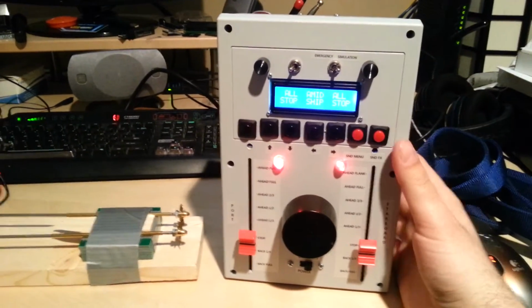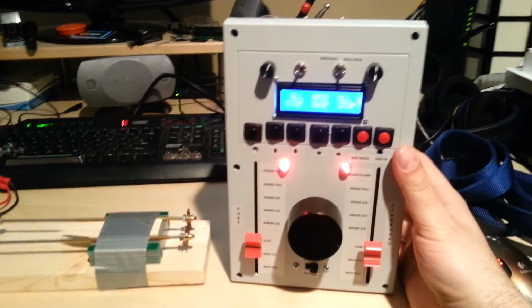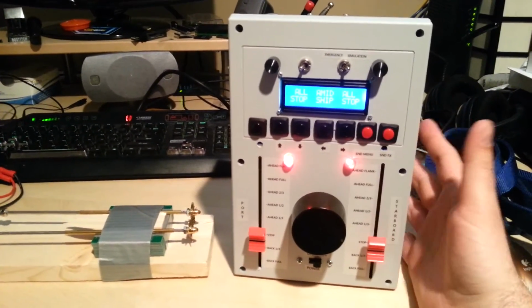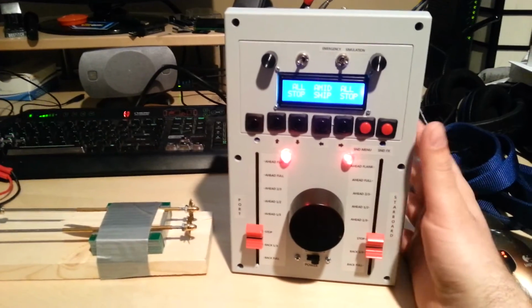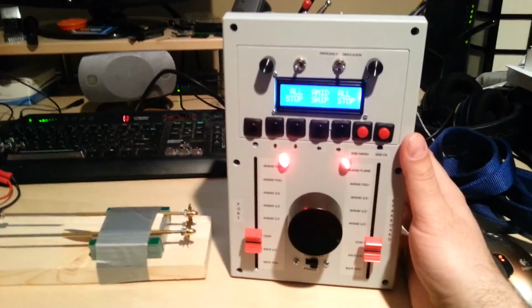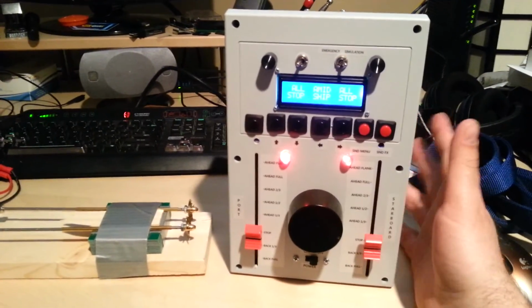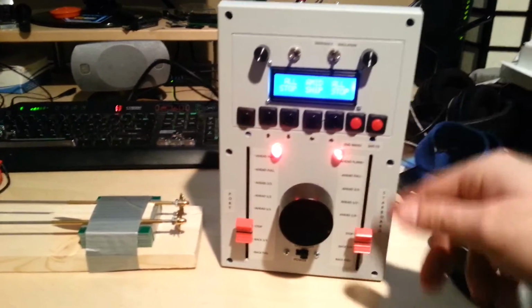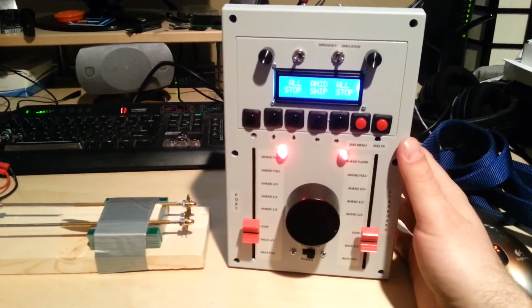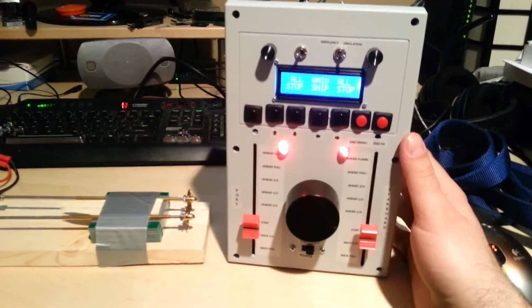Now, those are the only sound effects I have loaded on it right now, but I can probably put 150 different sound effects on the SD card. That's what room I have left. The MP3 module I'm using, you can only address 199 sound effects, and I'm using a bunch already for all the engine orders and different combinations of engine orders. But I could put a lot of sound effects on here if I want to. So I think that's pretty cool.